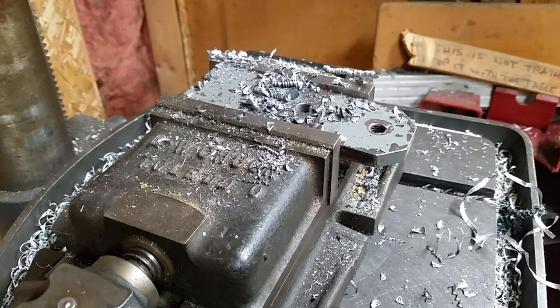I'm going to say that maybe the older Drill Doctors work better than the newer ones, because I know the one that Watch Wes Work had was brand new and this one certainly isn't - it's so old that everything is retired and I can't even get parts for it if I break anything. Maybe I'll sharpen a few more drills and get down to some smaller stuff. They do warn you that if you over-grind the smaller bits you get a reverse ramp, so I've got to be careful of that.